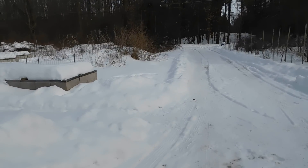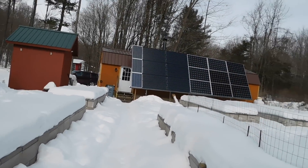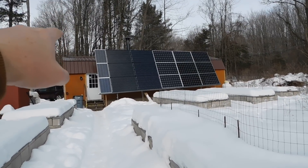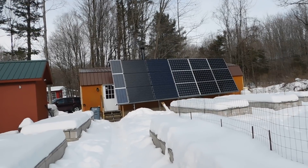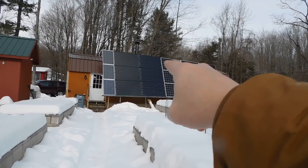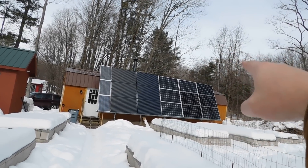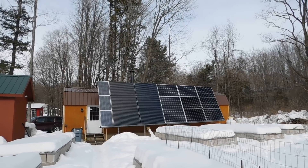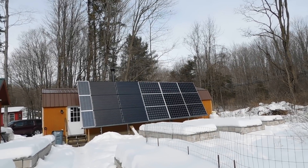We're going to start out here and talk about the solar panels. The one mistake I've made — I have three different brands of solar panels. The three panels on the end are 100-watt panels; those are Brian's, hooked up to the camper batteries. The first six panels are 250-watt panels — those were the first panels we bought when we got up here to the homestead six years ago. The next four are 255-watt panels, bought after that first winter. The last five are 300-watt panels.